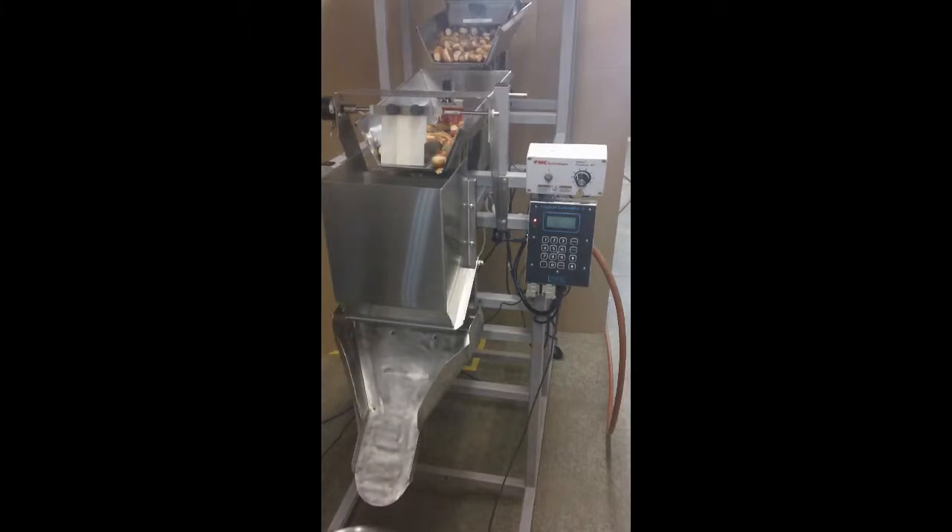This is a Logical Machines S6. This is a one pound run of pretzel bites. I actually had a problem develop with the standard weigh hopper between the half pound and pound run — a lot of product gets caught up in between the hopper body and the door and it doesn't discharge fully. So we have traded that out for a large weigh hopper now.